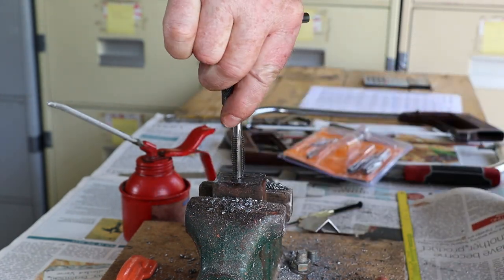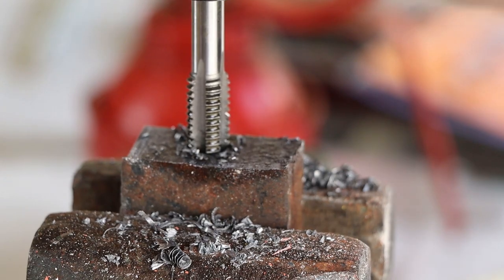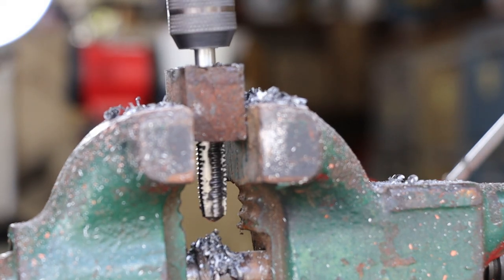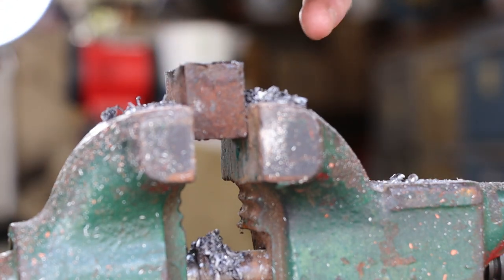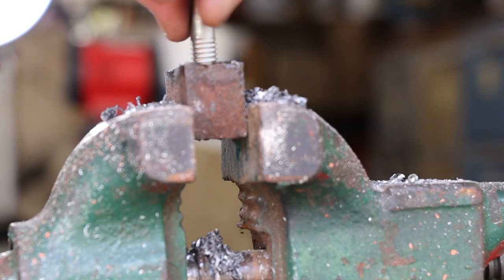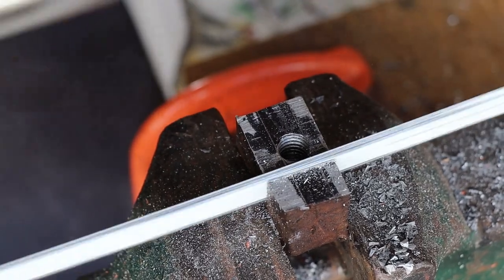Then we can drill a hole through the block and enlarge it with a bigger drill. Next we'll use a tap to form a 3/8 inch UNC thread inside the hole. I like to use plenty of oil when I'm tapping threads like this — make sure the tap's nice and straight when you're starting it into the hole. Once it's started I like to turn the tap 180 degrees then back it off a little to break the metal chips inside the hole. This hole goes all the way through the block so the chips will fall out the bottom. If we've done this right our square bolt should twist straight in there. Now we can mark out the cutting lines for the top of the wing nut and saw them down with the hacksaw.